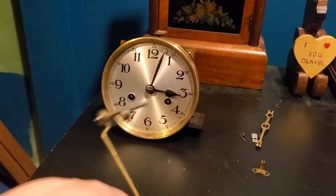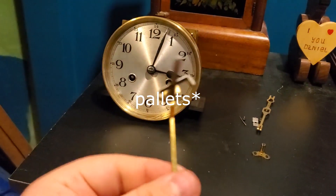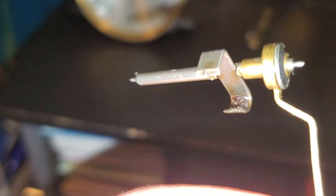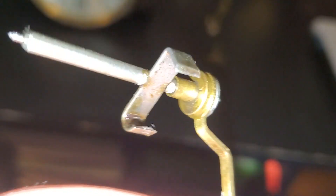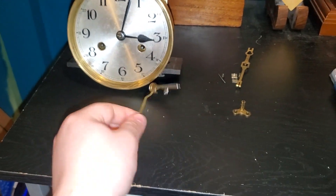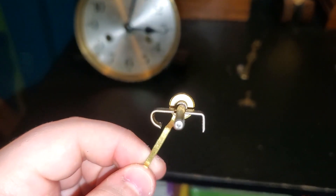It's not keeping time properly, so I went ahead and took off the escapement. There is quite a bit of buildup that needs to be cleaned off, so I'm just going to take a dry paper towel and scrub that all off. It's always knocking itself out of beat, so hopefully after this it'll stop doing that. There's your look at the pallets.